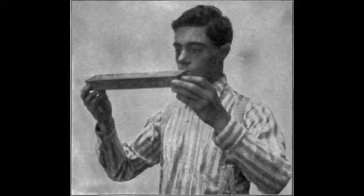If your blade is very sharp and you cut with the grain, you can get a great finish without a chip breaker, as long as you don't go too deep. You can even get a fairly good result against the grain, but it requires an extremely sharp blade and a microscopically thin shaving.